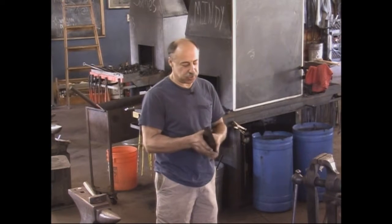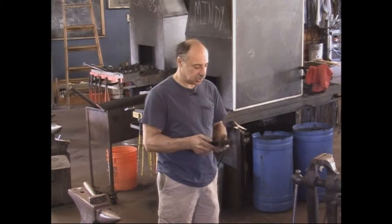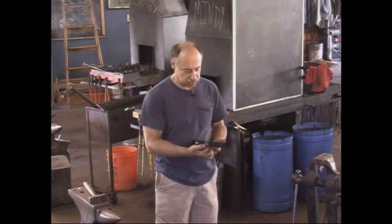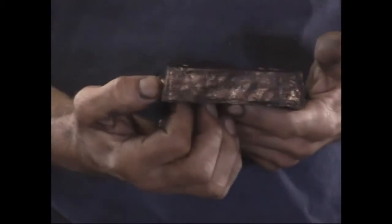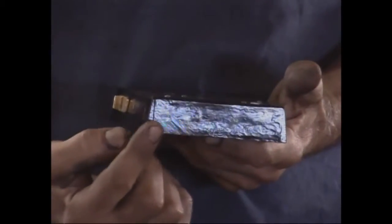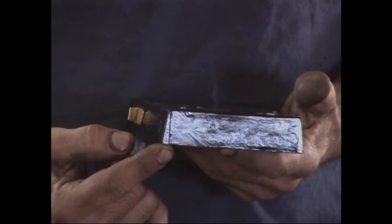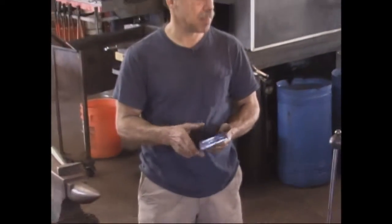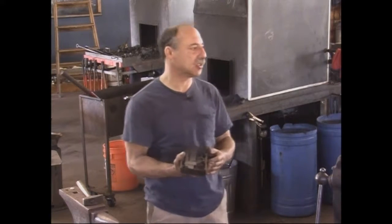In those regions, I think you could get the sheet in the right thickness. These locks have a tapered rail, which I'm going to do this morning. I'm just about to start on that. You can see the side rail is thicker at the bottom than at the top. So I think that was rolled to that shape and just sold as strips. Is that cast? No, there are no castings in this except for the brass parts. Everything else is wrought.